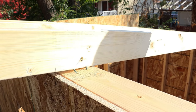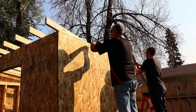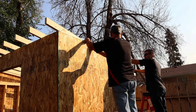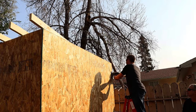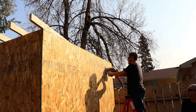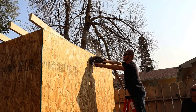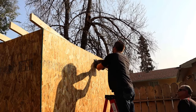On the back wall the roof trusses land directly over wall studs; on the front wall I'm just measuring 16 inches on center as we go. With all trusses in place, we can cut our sheeting material to the exact height needed — just snap a chalk line on the front and back of the trusses and that gives you the angle. How you choose to cut is up to you: I'm using a circular saw because it's quick and easy, but a reciprocating saw also works great and is far less sketchy if you're not comfortable with a circular saw.